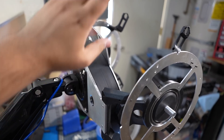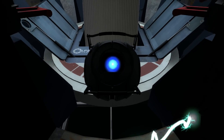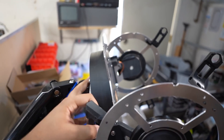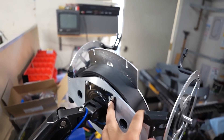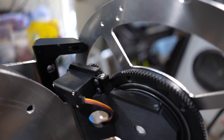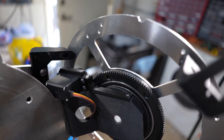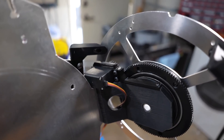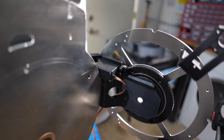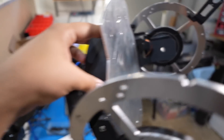As much as I would love to do a full 360-degree rotation along his inner frame — which would be mechanically possible — it would require a lot of changes to his design. I'll talk about that in probably a post-mortem on this build. The way this gimbals is via a stepper motor to this very large fixed outer gear, so this is a 4-to-1 reduction. These are fairly weak servos, but this gives it enough oomph to tilt it back and forth.